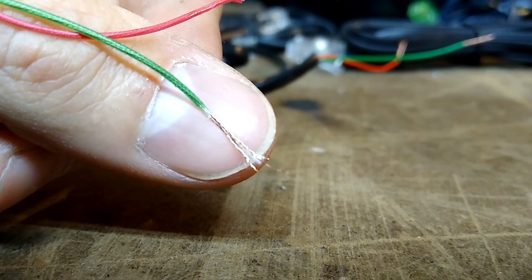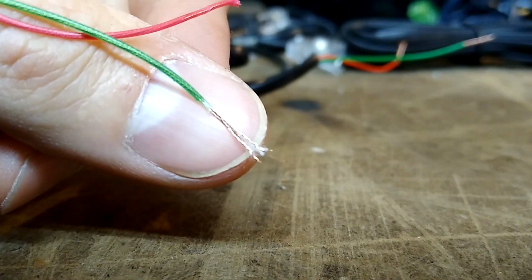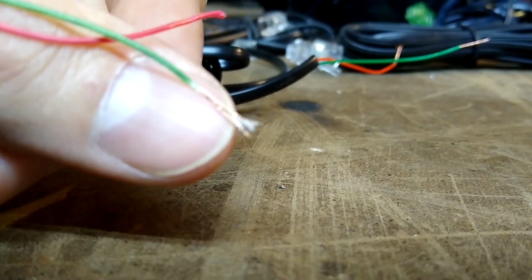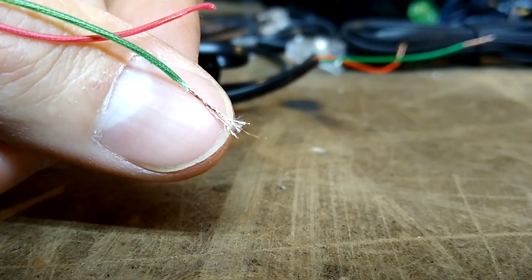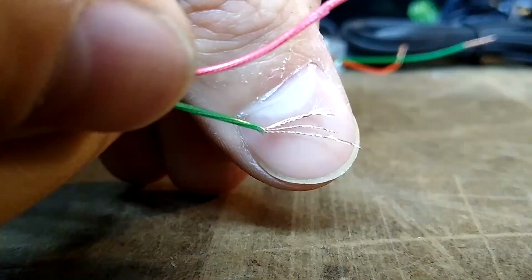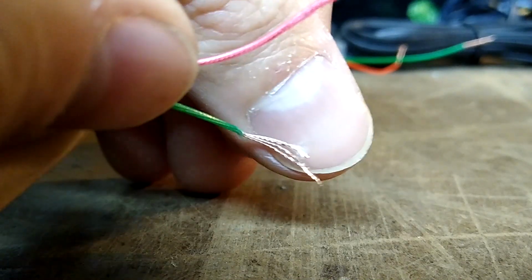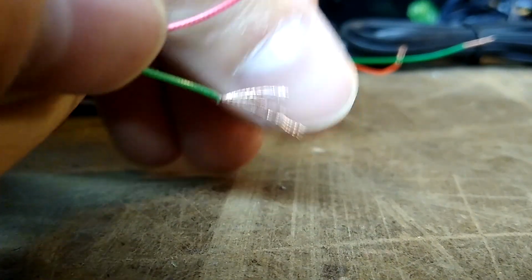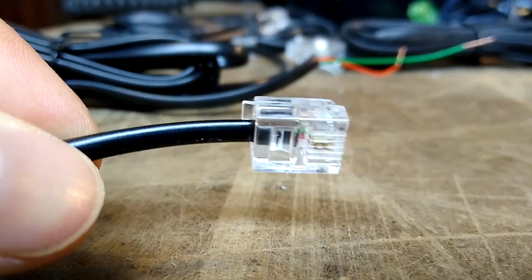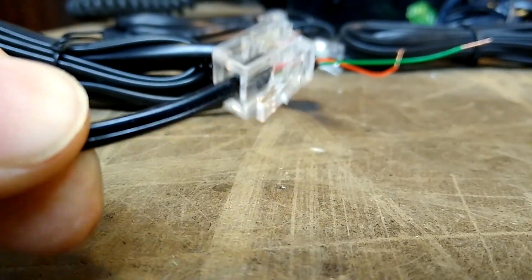This style, where there's about 4 strands, each strand has a cotton core that the copper double helixes around. I utterly despise this style with the cotton core. It's very hard to solder into a cohesive bundle. It's very difficult to work with, unless you're planning on using ends like this or special phone company crimping tools